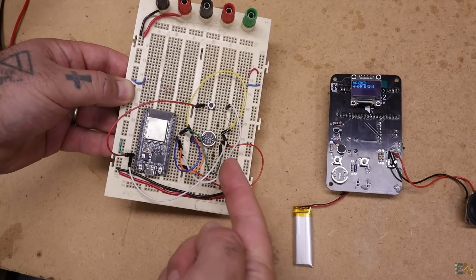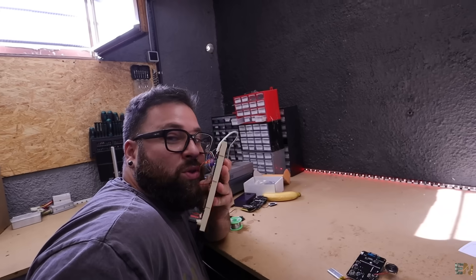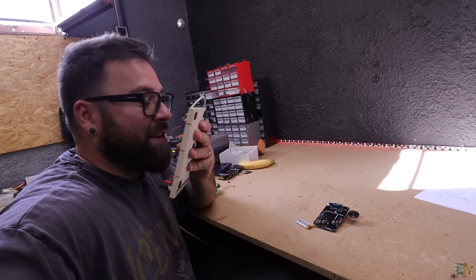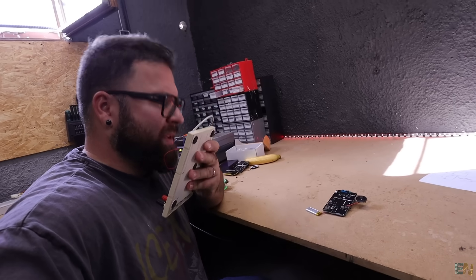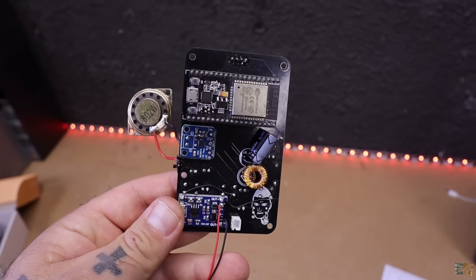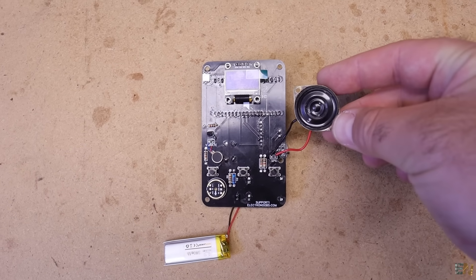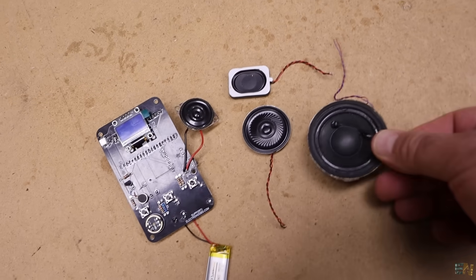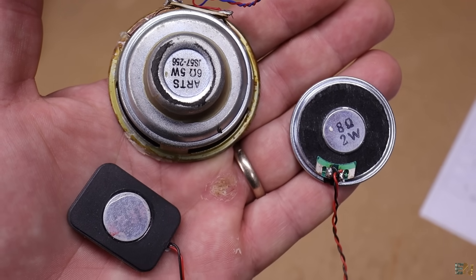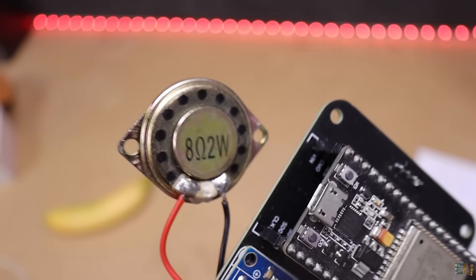On a side breadboard I connected the microphone to the ESP32 and a push button just to make a test — and it works quite well, the sound is a lot better than I expected. The quality is very much affected by the speaker. With a bigger speaker the quality is a lot better, but it's quite big, so I'll go with lower-quality speakers for now and I've already ordered better ones for the future. If you get bad quality sound, it's more a problem with the speakers and not the DAC.